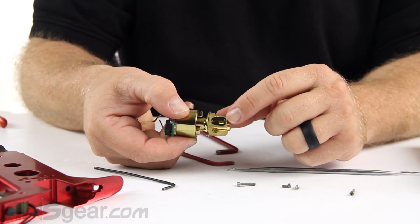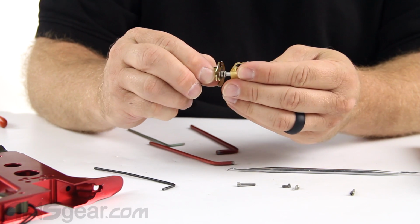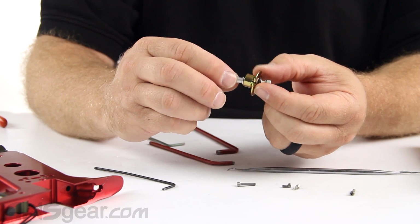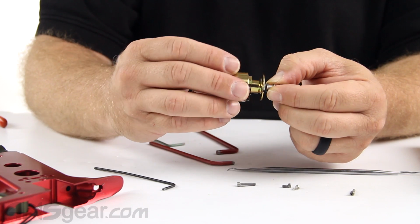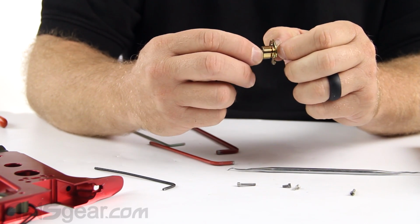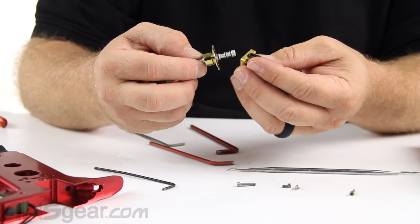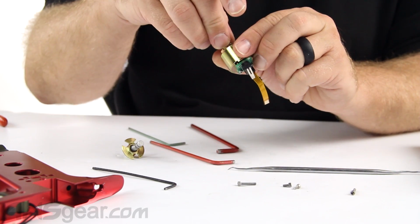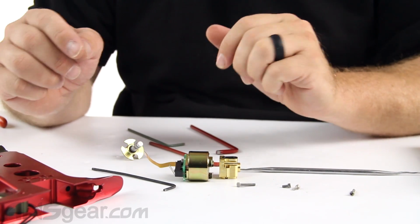So here's our air. This is our air input on this side, and this is our air output on this side. Depending on where this spool right here sits, it controls airflow by moving back and forth inside there. Now that spool is controlled by this electromagnet over here. So when this turns on or off, it makes the spool move back and forth. It always seals up, but it changes positions and directs airflow through the solenoid. Pretty snazzy, interesting little setup on there. So you shouldn't have too many problems with your solenoid. I haven't seen many solenoid issues with this gun so far.